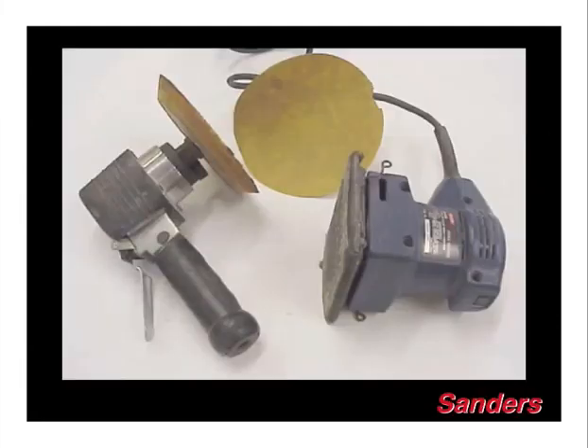These sanders are also used extremely rarely unless you choose to do certain tasks. On the left-hand side is a DA or dual action sander — it's a pneumatic tool and very useful for final finishing work on long components. On the right-hand side is a palm sander, also available just about anywhere. This version is electric. The palm sander is very nice — for example, you can chuck in some Scotch-Brite and use it to prep your airplane for paint.